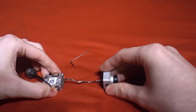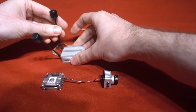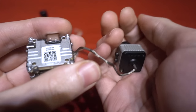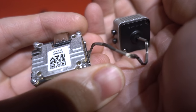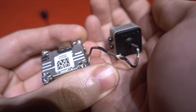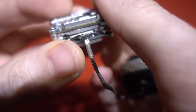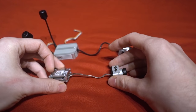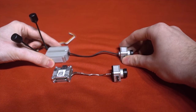Inside we have the camera which is almost identical to the one that comes on the larger air unit, except it has a black backing and the harness to the main board isn't as protected as the air unit - it's more reminiscent of the CADX hybrid and split cameras. It does have some stress relief on the camera side and on the Vista side the connector is also clipped down. The harness is shorter at 70 millimeters compared to the air unit's 105 millimeters.